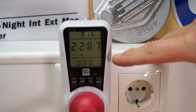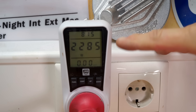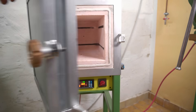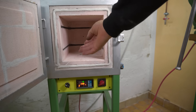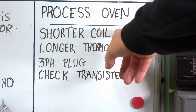I obviously designed it with the coil too long and I need to make up a new shorter coil, because I want to be somewhere between maybe 3200–3300 watts. At only 2.4 kilowatts, it's taking excessively long to heat up to 900 degrees for heat treatment — like three and a half hours. So to increase the power, I need a shorter coil to increase my heating rate.